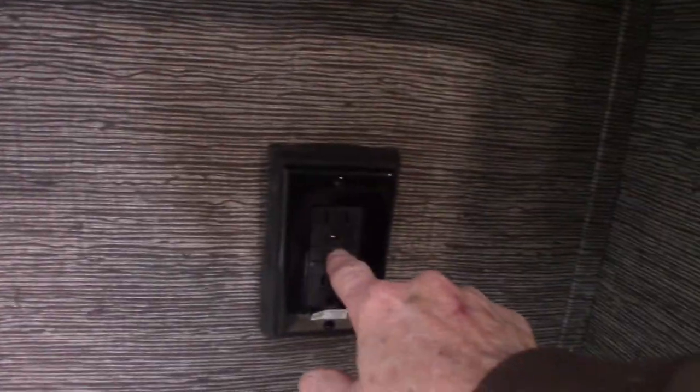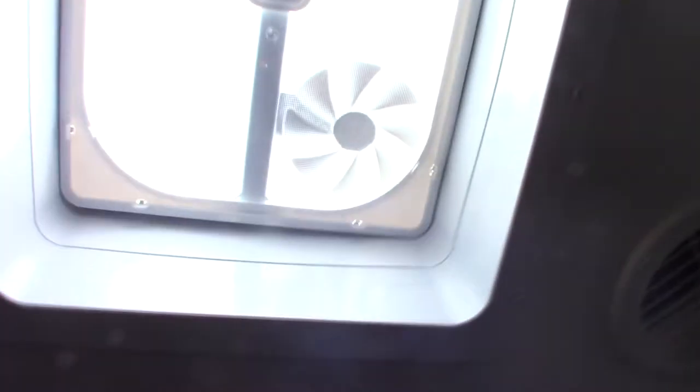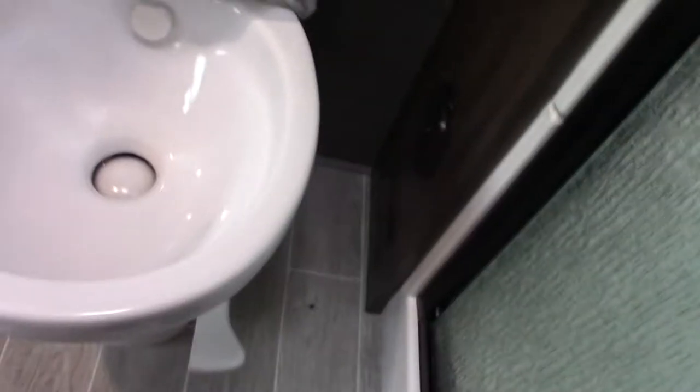The sink and shower work like any other — keep in mind this outlet is a GFCI. There'll be one more GFCI in this trailer; all plugs are wired through a GFCI, even the one on the outside, so if a coffee pot pops outside you reset it inside the trailer. Always run the fan with the shower to pull humidity out.